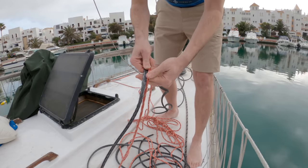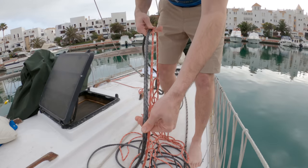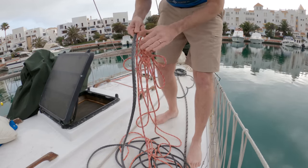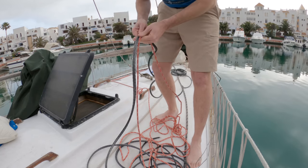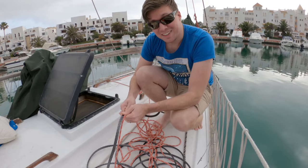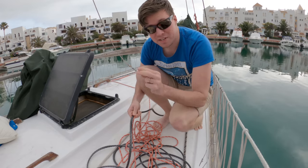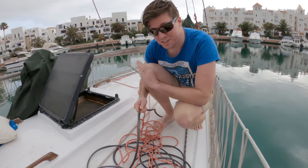When you're doing it, you pinch the messenger line and the Dyneema stay together, then release over here, let them pan out but keep them parallel — just keep running along like that and you have a one-to-one. There's no question of miscalculation. As the old saying goes: measure twice, cut once. We're going to measure this once, get a rough idea, then measure again and make sure we come out at the same spot. When I can measure it twice and get the exact same marks, then I know I'm ready to cut — and I don't cut before then.